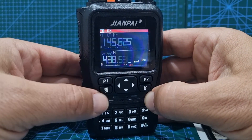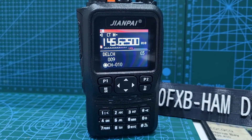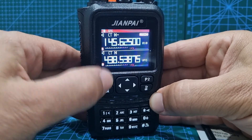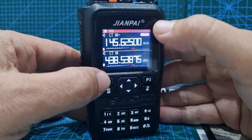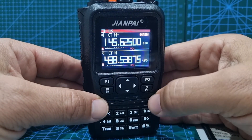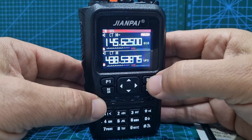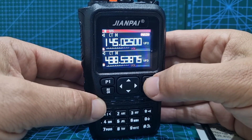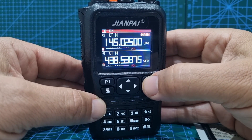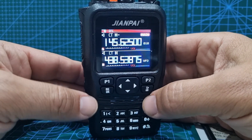There is another section for deleting channels — go to menu, delete channel — but I'll cover that in a separate video. Thanks for watching. Remember: A and B is selected with P2, main and sub. You transmit on the one that says main but can receive on both as long as you've turned on TDR in the menu. Also remember: frequency mode is VFO, channel mode is memory mode where you get numbers and can scan through them. 73.